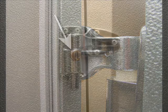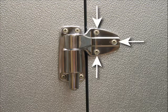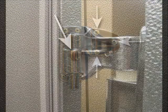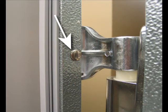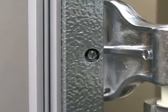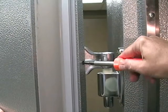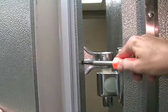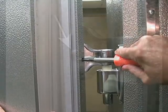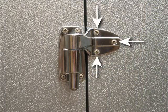Before any adjustment, you must first slightly loosen the screws on the hinge strap on the door approximately 2 turns. Loosen additional screws on other hinge straps on the door approximately 1 turn. Then pop off the chrome plug button. Now you can access the adjustment screw. You should only make minor adjustments and then close the door to view if the adjustment rectified the situation. When adjustment is complete, replace the chrome plug and re-tighten the screws on the hinge straps.